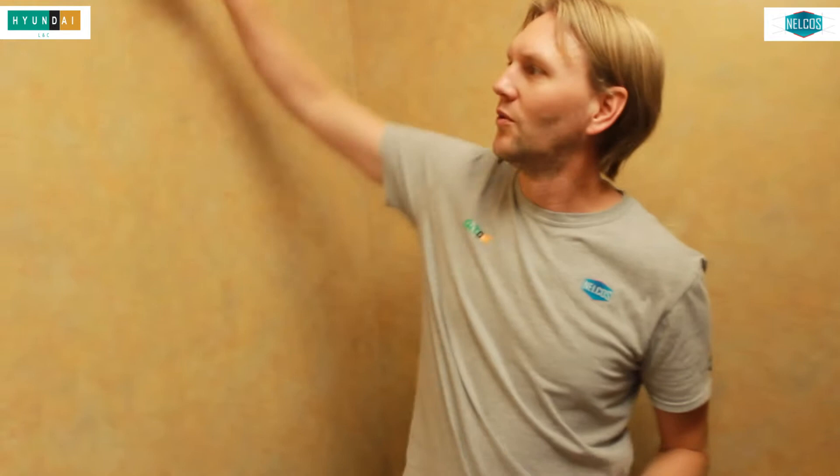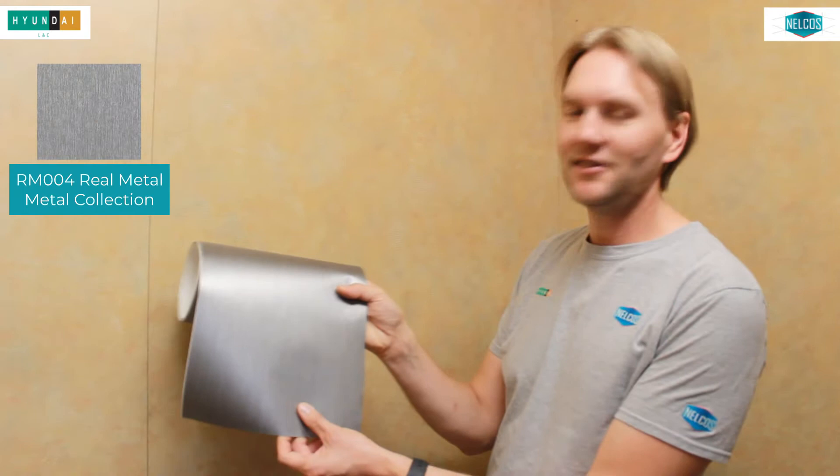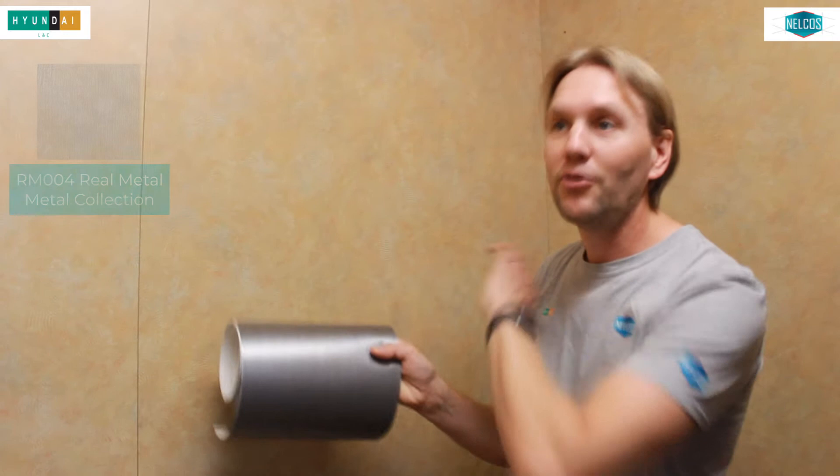In here we've got melamine panels. The surface and texture is great — it's a really durable finish — but it's really outdated. We're going to use stainless steel architectural vinyl and give it a really nice finish top to bottom throughout the whole elevator. On the ceiling we're going to go with a pearl white which is really going to make it come back to life. It's a fraction of the cost of changing out any of these panels, and by wrapping this we're also saving on the cost of having to bring in an elevator technician to get access behind the elevator. That saves us a lot of money right there, let alone changing out the panels.